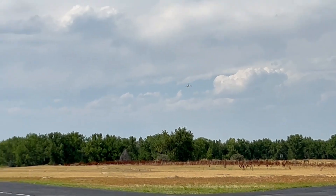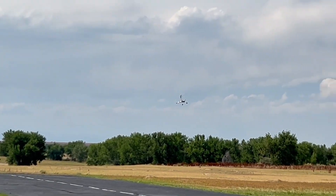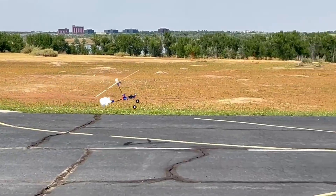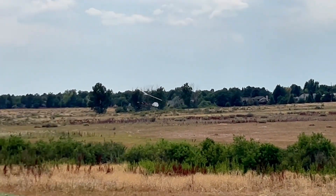However, the more I flew, I could definitely tell there were some issues with the rotor system. There'd be random times during flight where the whole aircraft would just randomly drop and require a lot more throttle to get back up. It just didn't feel like it was sustaining its rotor RPM very well, and over time it seemed to be struggling to gain altitude.